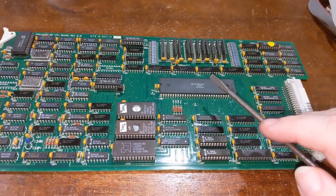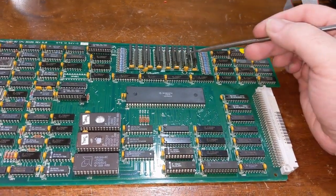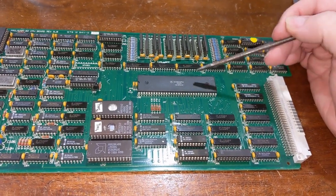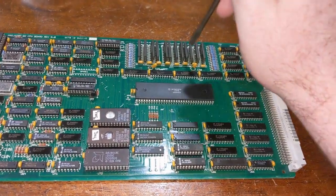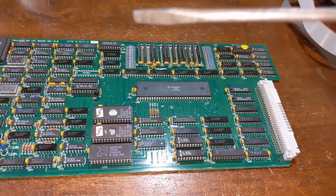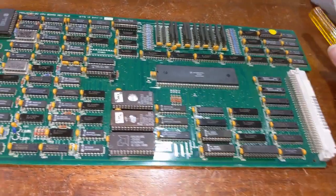So, the CPU, the satellite could download everything to CPU. This would contain a RAM disk that has a shared allocation table between this processor and the video processor. So, the video processor can reach back out into this memory and grab things through a DMA concept without this thing even needing to know.